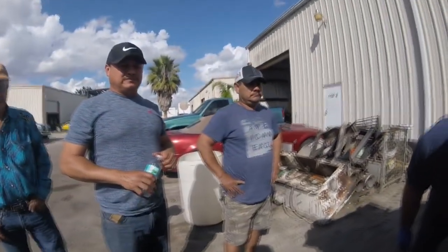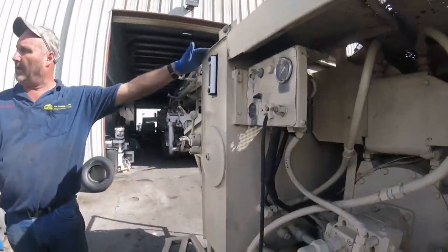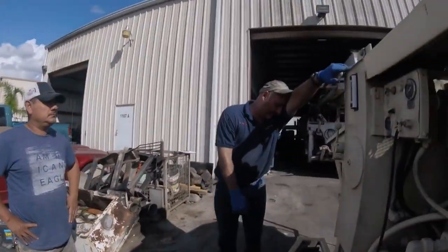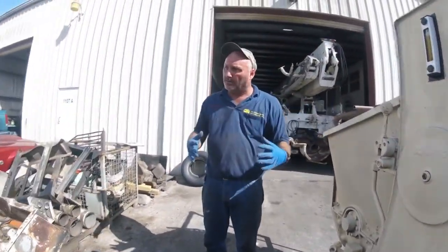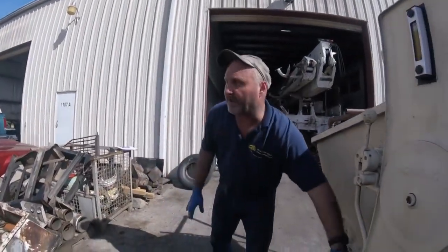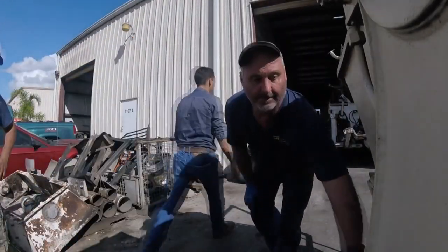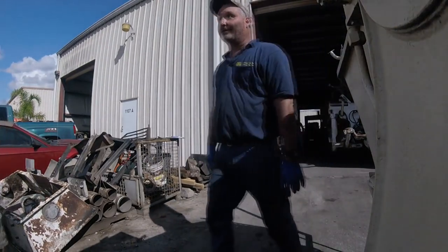You got your main tank filter here. And your hydraulic tank here. That fluid is AW46 hydraulic fluid. AW46. There's a low part on the tank. When the tank gets hot, cold, you get condensation. The droplets run down. There's a V at the bottom of this tank, the low part. Here's the drain. Once a week, you're going to do that, just like on your Reeds. If you don't, you better start.